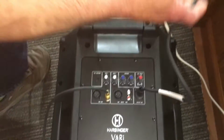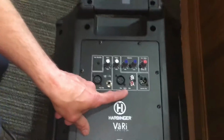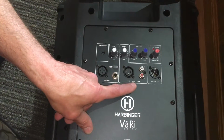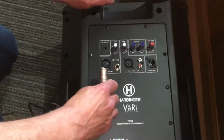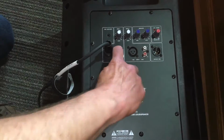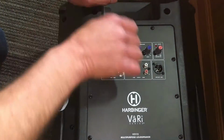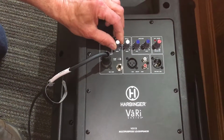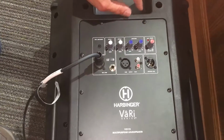So we're going to bring this cable across to the next monitor. And you're going to see on this input 2, we can input on 1 or 2. So we're going to input on 1, plug it in there. Now on this one, it's down because this is considered a microphone cable. You'll see where that is. Again, your master volume is going to be adjusted with these 2 volume levels there.